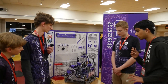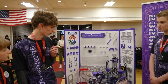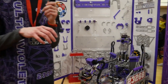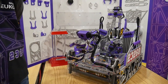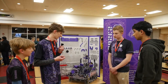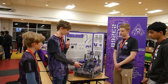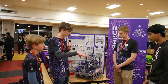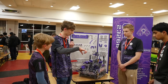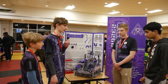Any challenges you encountered with your intake, or any refinements you had to do to get to where it is today? One big thing with the intake was that it had a really big problem trying to pick up specimens if they were right next to each other. So we added a color sensor to center the claw over the specimen or sample. Then we changed the programming to close at a certain time that basically guarantees we'll get any sample we want, even if they are right next to each other.